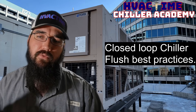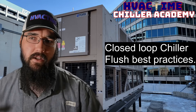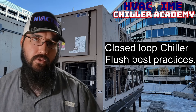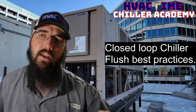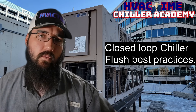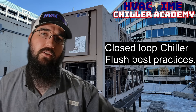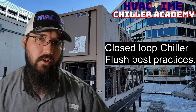In terms of flushing, be very mindful of your chemical treatment — don't throw it out of whack. Always have your chemical company involved in that process. If you do have to do an actual flush, we've probably got a pretty severe scenario. There are some cases where they can put certain chemical treatment in that will actually stabilize the water so you don't have to do a full flush. Talking to some of these guys, there are things they can do that will help allow heavy sediment in the water to settle because of the chemical additives they put in.